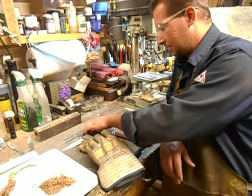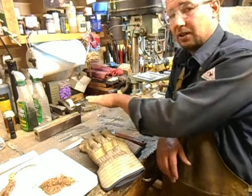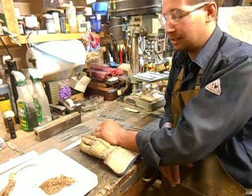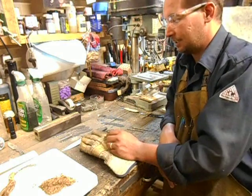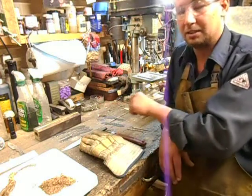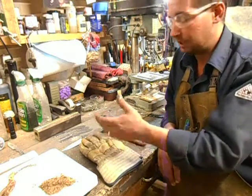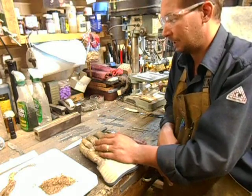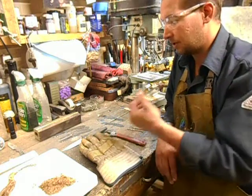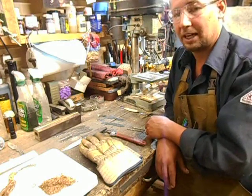I did leave one set of these knives that I did not break, so I'll go ahead and try drawing the spines and the tangs, and then do this flex testing again to see if that makes any difference, if I can get a differentially tempered blade instead of a differentially hardened blade, in case I want to build a knife that has the advantages of differentially heat treated knife, and go a little bit longer or hotter on the temper, and I think they'll be ready to roll after that.